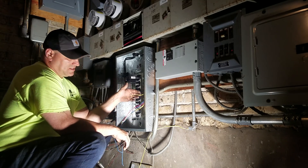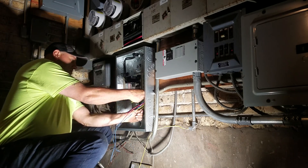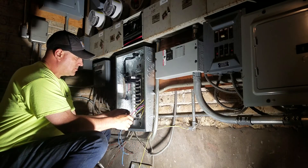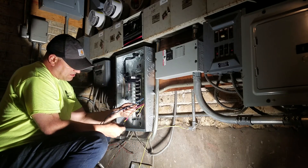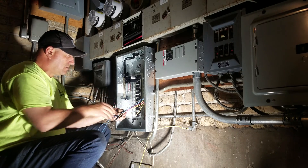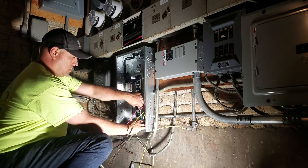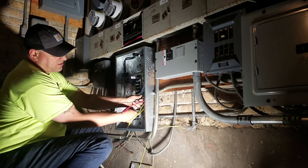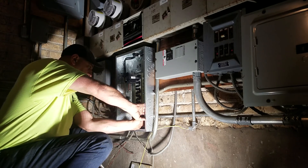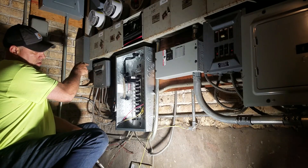You see these? These suck — they were that short. So now I'm gonna go with my conductors and get them in. I'll leave those two short ones for later. This one was taped off and never hooked up, so I'm just not gonna hook it back up. You see I'm leaving wire there, but you also want everything to be in 90-degree angles — like a circuit board. You want it to look right.